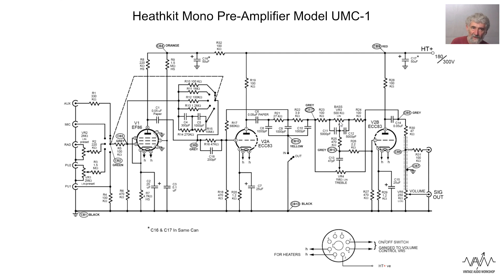Therefore the signal is increased. There is a frequency selective network - otherwise it would simply be another volume control. This is the bass control. These two capacitors short circuit the treble frequencies across the pot, and therefore it is only effective at low frequencies.